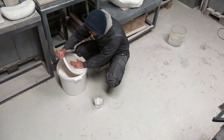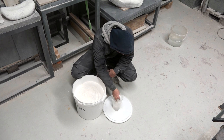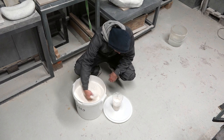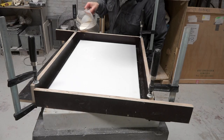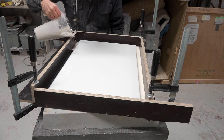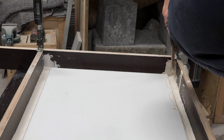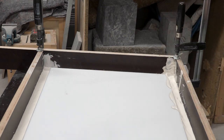So it's time to prepare and pour the plaster. Let me explain that I'm pouring the plaster in two stages. The first one consists of an initial pouring of a small quantity of dense plaster into the mold. The purpose of this pouring is to seal every possible gap left between the wooden panels, so that the second, more liquid and heavy pouring, will not seep through any eventual opening — resulting in the loss of the plaster, not to mention the mess this makes and the time required to clean everything up. I'm also using this thick plaster to seal the corners of the construction all the way up.